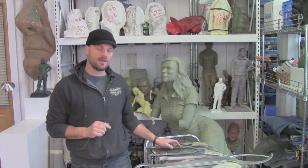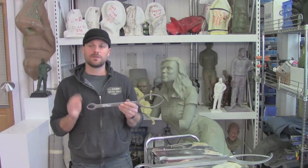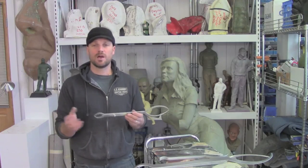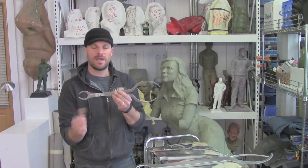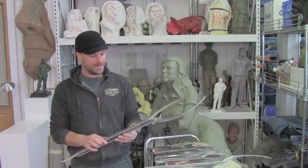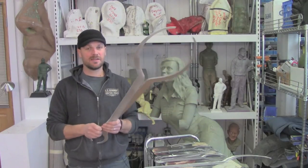The way we've remedied that in our studio is by creating calipers for every specific enlarging scale. We have these for three times, two times, four times, and five times enlargement, and we even have a few where I don't know the exact numbers — I just know it did exactly the right scale for one specific maquette to get me to my final size. My favorite set are these three-foot calipers — these are a pair of blanks not yet assembled — made out of one-eighth inch aluminum, and they can do some serious monument measuring.